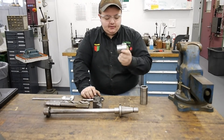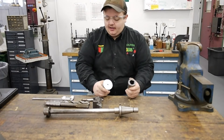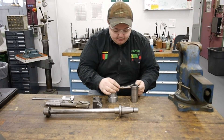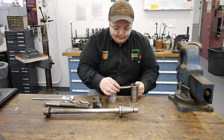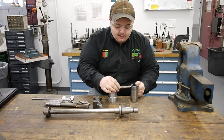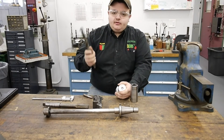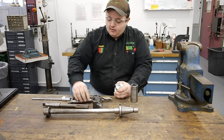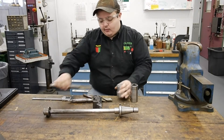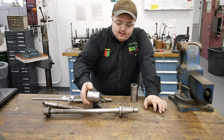We're going to take this piece of what I believe is 4140 and turn it to 1.875 OD, which is the diameter on this part. I haven't tested the bore on the overarm support with the telescoping gauge yet, but this is reading a thou under 1-7/8. We're going to drill it 55/64 - just under 7/8 - and then take a 7/8 reamer. Right now I have sleeves on these from Morse taper 2 to Morse taper 3, and we'll go ahead and ream that hole out.